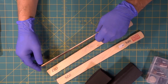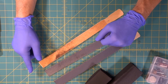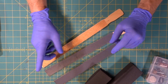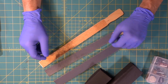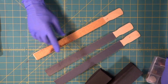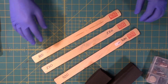And the way you do that is you make yourself some kick butt sanding sticks. Very easy. Pick up some paint stir sticks from the local hardware store. Pick up the 3 different grits of sandpaper you need. Cut your strips. Bring in some sort of a double-sided tape. And if you don't want to use double-sided tape, you could always use a spray adhesive like Super 77, because that stuff is the bomb. You could always just spray your stick with Super 77 and then apply your sandpaper to it. I like to use double stick tape. It's whatever you like to use. So, sanding sticks. Love them, use them, live by them.